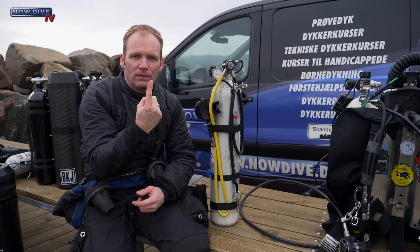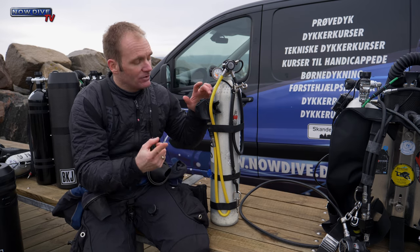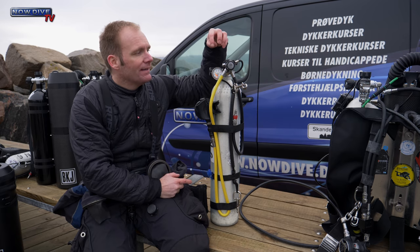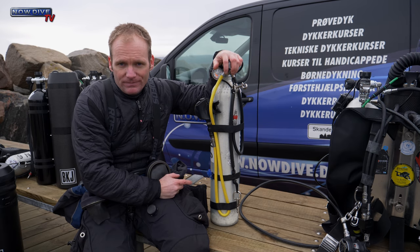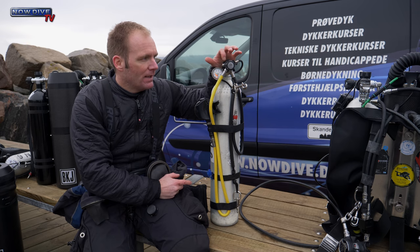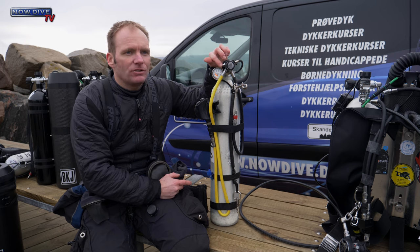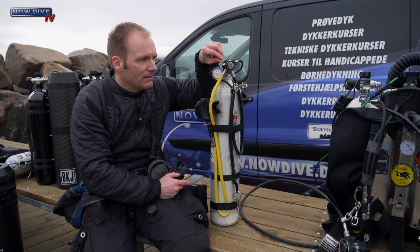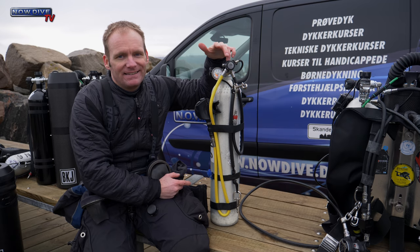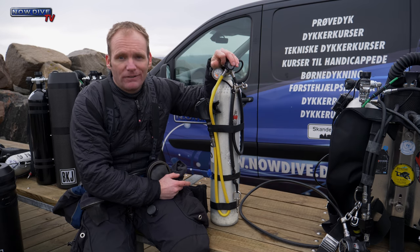If it slowly creeps up and up and up until your second stage starts blowing, or until the OPV starts going, your first stage needs service. There's nothing wrong with your OPV. It's functioning as it's supposed to. I've seen a lot of threads on internet forums and Facebook pages where people say, hey, I have a problem with my OPV. I need an adjustable OPV so I can adjust the pressure when it breaks, because it keeps bubbling. Well, it's the first stage problem. Your OPV is working fine.